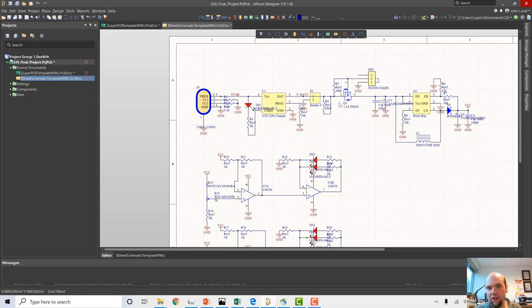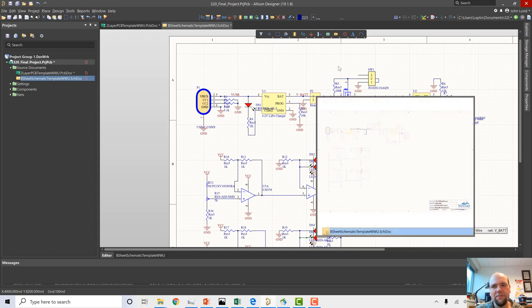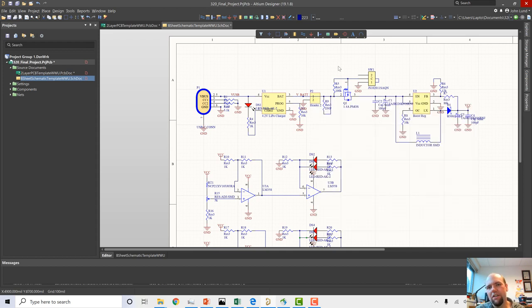We're going to get the same voltage across the diode. So the current's going to drop through the LED, and so basically as the battery dies, we're going to get slightly dimmer. It's probably not a big deal. It probably wouldn't even be a visible deal, but I generally don't like it. It's the only reason I'm going to power the LEDs off this regulated connection.